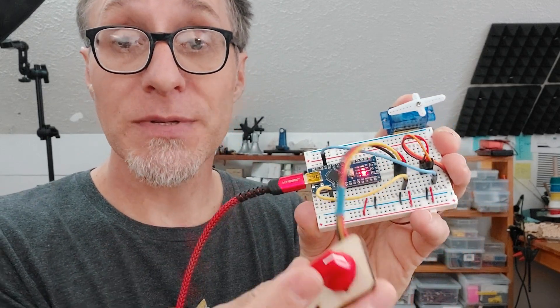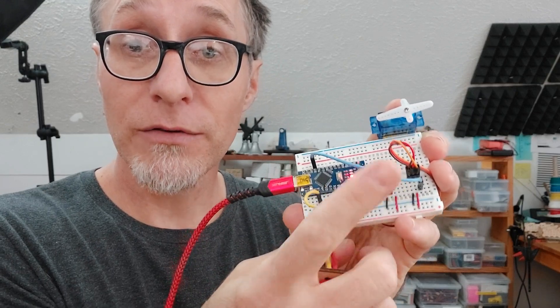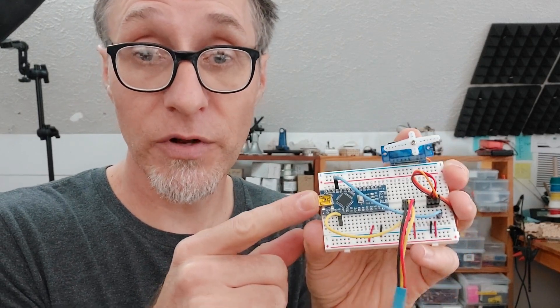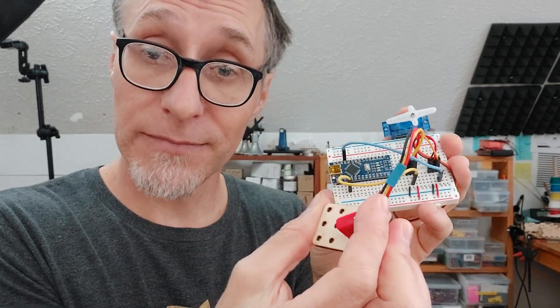This is not copacetic. I am using the Arduino's five volt power to drive that little motor, and this is a no-no because you are putting extra load on the voltage regulator for the Arduino board. The Arduino board should only power itself or maybe input devices like a knob. Motors, LEDs — anything that requires power needs its own power supply.